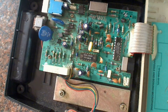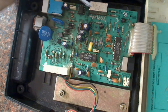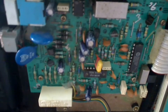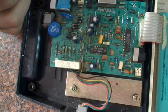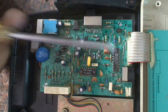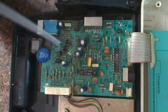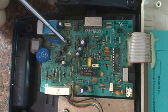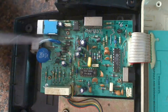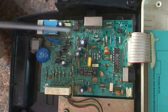There are a few small box capacitors — that one is marked 1k63. There are also transistors and two switches. I think one switch is used to set the tone volume and the other for the pulse. Looking more closely at this part, there are two capacitors with diodes — I think this is a bridge rectifier circuit.